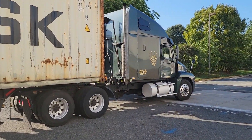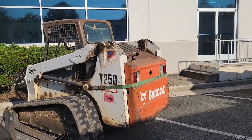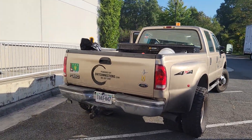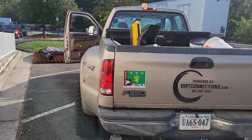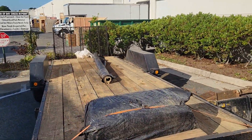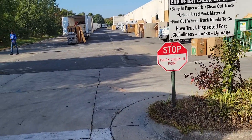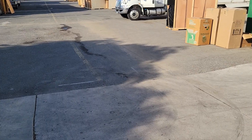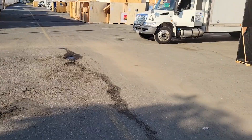Good morning my neighbors. It's Tuesday morning and I'm mobilized to the site. I got the machine and I got some material on the other side of this pickup truck that's been delivered — my wire mesh, expansion joint, and my chairs. Three inch chairs to hold my wire mesh up. Tomorrow we're going to bust this asphalt up, grade to uniform depth, and prep this for Friday morning pour.